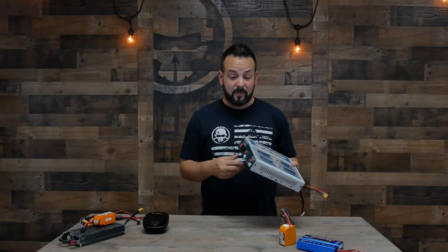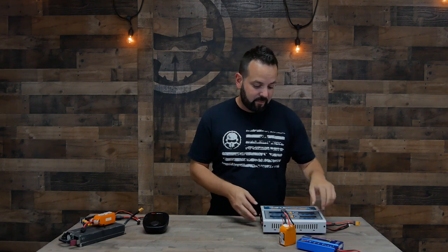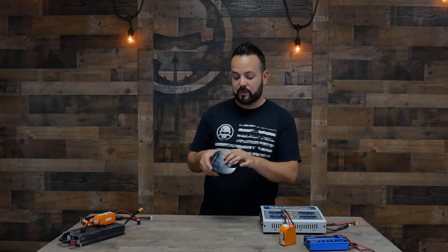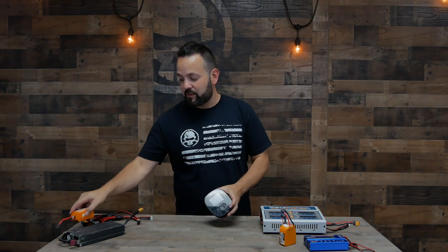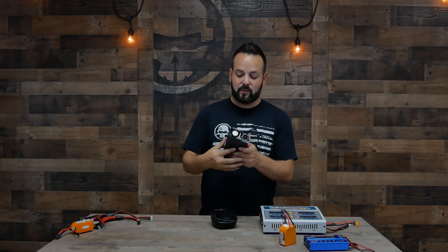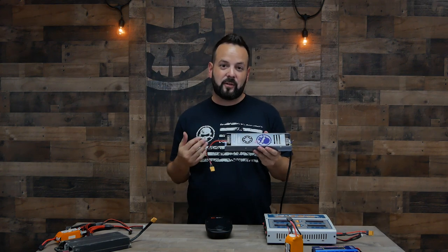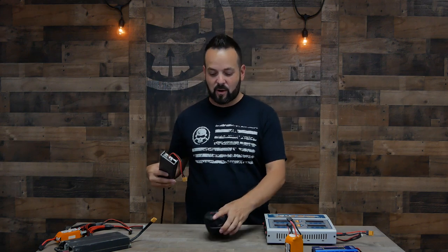The other thing to know is whether it's an AC or DC charger. This charger is an AC charger, meaning you can plug the power cord straight into the wall. This one takes a computer-style power cord; this other one takes a barrel plug adapter. Over here we have a DC charger — it doesn't have a power supply built in, it has an XT60 plug. You need a separate power supply. I use one from a server that I bought off eBay with a small modification to add an XT60. We also have this power supply in the store — no modification needed, just screw on the terminals, attach your XT60, and you're in business.